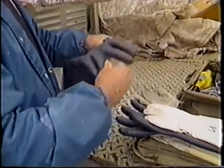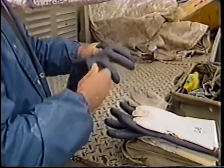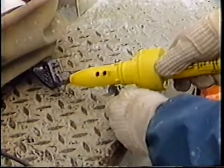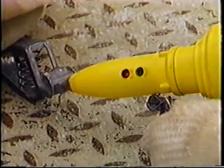Remember, rubber gloves should be thoroughly examined before each use. The B-bond should be tested for continuity also. If a current passes through the B-bond, the rubber insulation will begin to smoke. The metallic strips within the clamp assembly will not. Should smoke appear, do not make contact with the work area. Secure the area to ensure public safety. Then notify your management center.